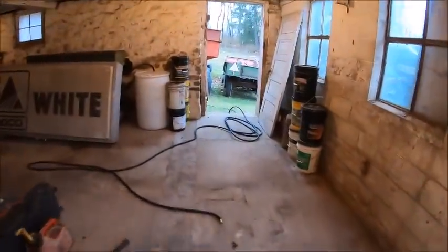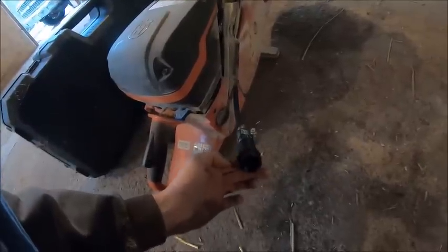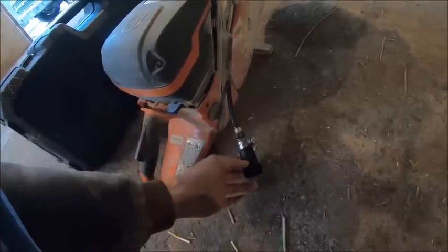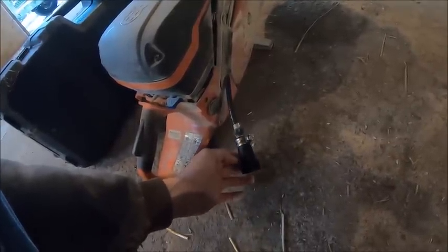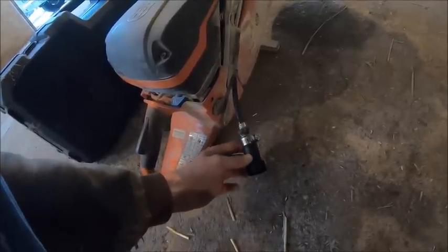I made sure I had enough garden hose to get down here to the barn, because you got to run water to the saw, and that's another thing I had to do after I got it. The guy I'm borrowing it from didn't have the little quick attach dealio that hooks into here so you can hook a garden hose to it, because he apparently never got it. So I had to kind of hillbilly this up, which actually didn't work that bad. Just took a garden hose repair end, and it just happened to be a 5/8, basically the same size as a 5/8 hose, and the barb on the garden hose repair end happened to be roughly the same size as the OD on the little quick attach coupler here. So basically just took a 5/8 hose and slid it over there and hose clamped it, and shouldn't leak.